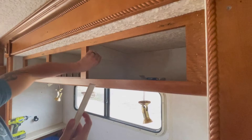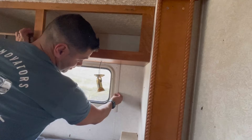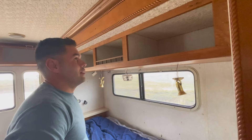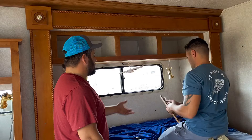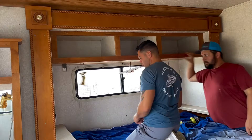You can also save these trim pieces for later on. If you have gaps, this trim is essentially like tape — so if you have to cover up somewhere else, just replace it with the trim. We tend to paint the whole RV so we usually don't use those, but that's a good tip. That piece of trim in the middle I just popped up with the little crowbar — it was just nailed down. Then I kept working on the trim inside of the cabinets, and once I removed all of that stuff underneath, I was able to just pop up that panel and it came right down.